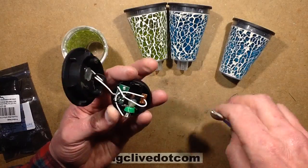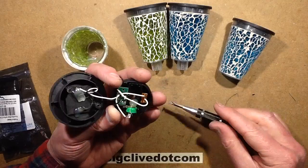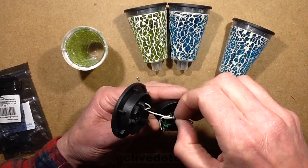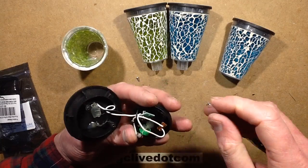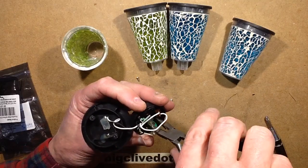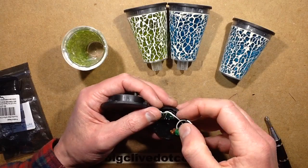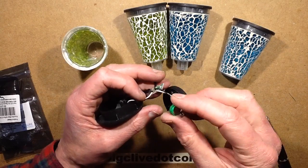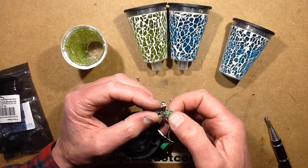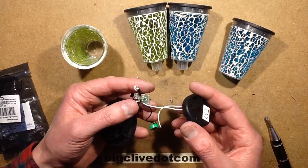It's the fairly usual arrangement — there's a little circuit board with one screw holding it in and a little button cell. These things cost a pound, and what you're getting for your pound is lots and lots of glue apparently. They've glued a wire down there. You're getting a little nickel metal hydride cell, the chip, the little booster chip, the inductor, the LED, and a solar panel. It's just ridiculous — it's actually worth buying these just for the components.